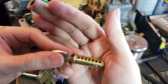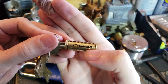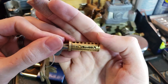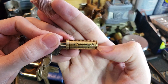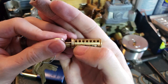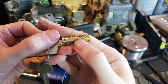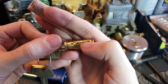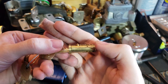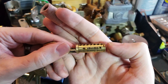Here at the back, you can see the check pin that actually projects into the keyway. The linking lever runs through these holes. There's probably a little spring at the bottom of this hole to get that lever to push back and bias itself so that this will always project into the keyway. And this will stick out into the plug. And there is the second locking lug that projects into the body and sleeve. Then that little metal pin in there acts as a pivot.